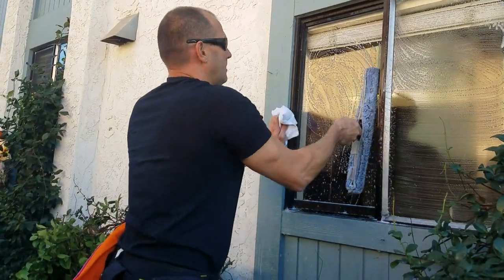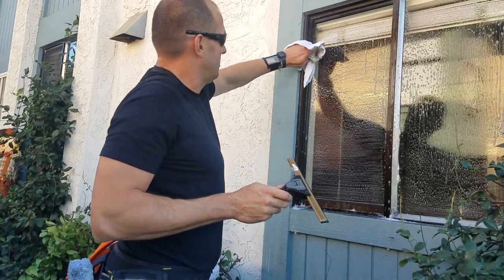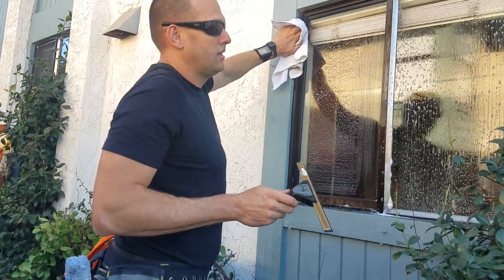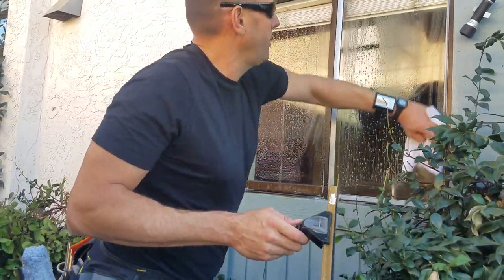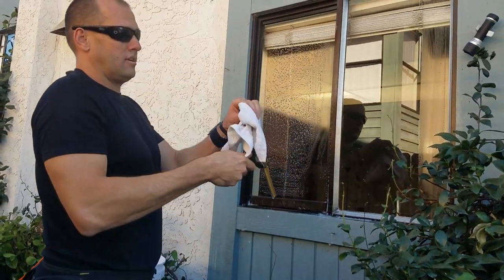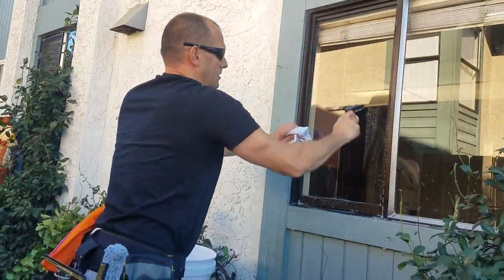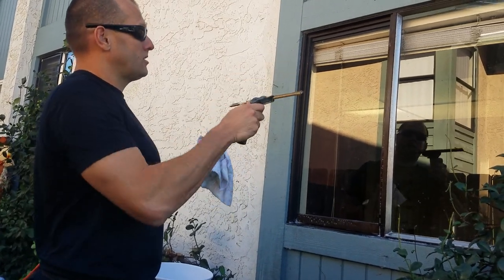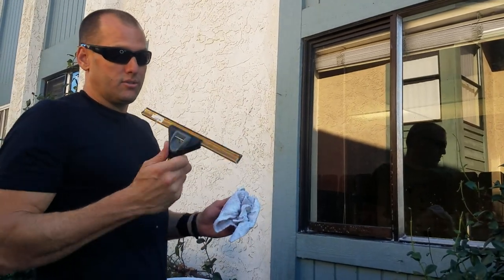If it's in the sun, you're going to want to do your best to squeegee some water off of that so it doesn't bake in the sun. It's pre-washed. Now I'm going to wipe down the sills and pre-rag the window. Wipe down all the sills — they're going to look a lot better this way. And I've pre-ragged the window. Then I'm just going to pull down, wipe off, pull down, wipe off — and they're basically washed. The technician could come by, and this is kind of your intro into squeegee. You might get to where you've pre-washed for them and just washed all the windows perfectly. Maybe rag a little bit, and maybe you're done. This is your intro into squeegeeing — anyone could pull down a squeegee two times.